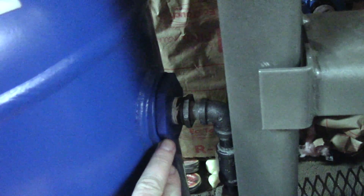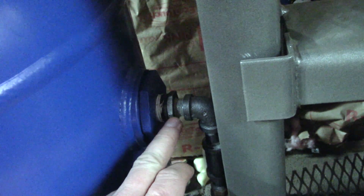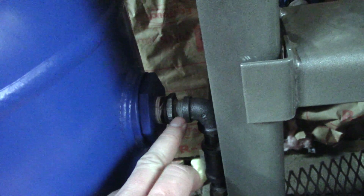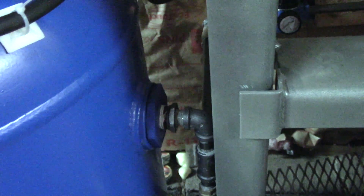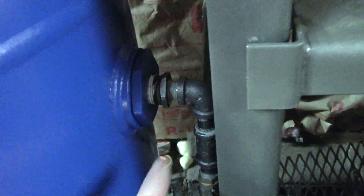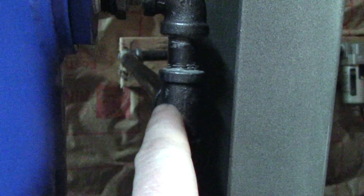They also sell what they call a shutoff kit. Coming out of the compressor is three-quarter-inch national pipe thread, which then reduces down to a valve — but the valve they sell is not rated for this compressor, and I've heard several people say it will burst. So I went to the black iron section at the store and bought a three-quarter to three-eighths reducer instead.